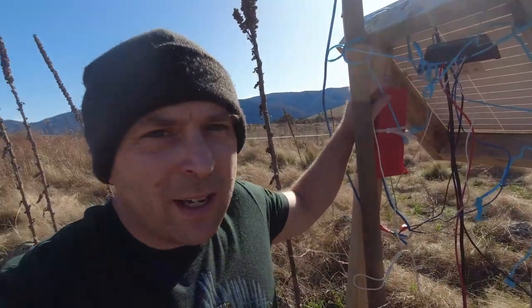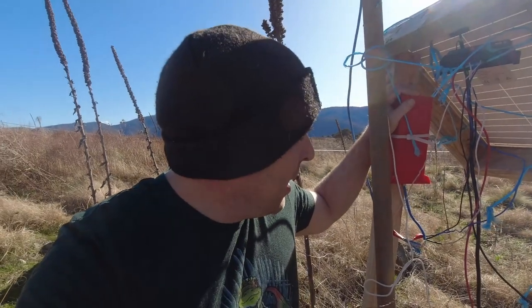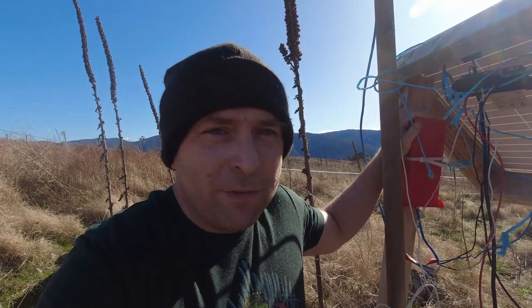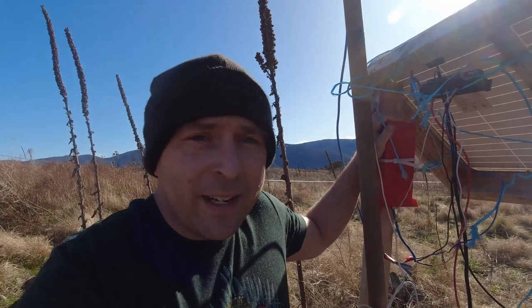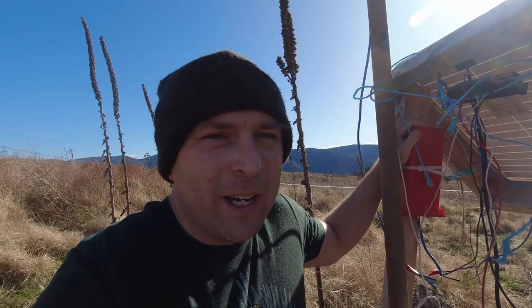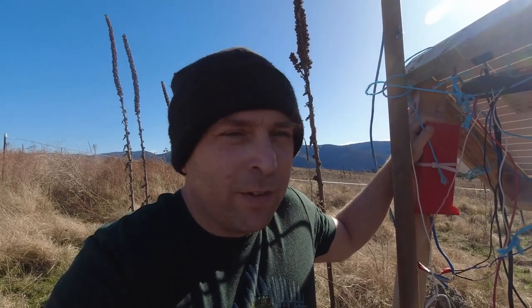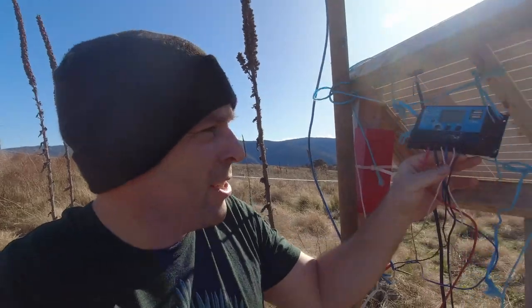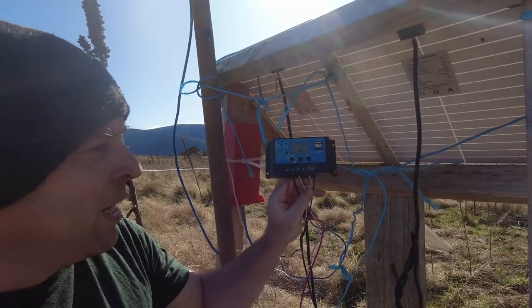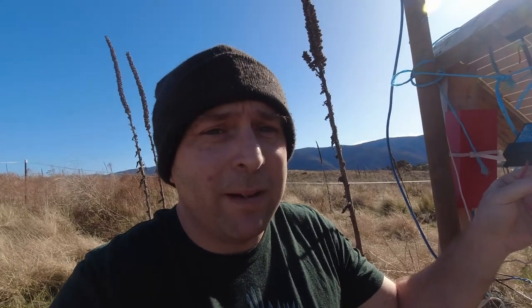To power this we've got this little contraption here behind me. I made this — it's a 3D-printed battery holder — holding my own custom battery pack that I put in there with the BMS and everything. I'm powering it through Power over Ethernet. Instead of having a PoE adapter plugged in here, meaning I'd need a 240-volt inverter and all the rest of it, I'm just running it straight off this very nasty, very dirty, cheapest solar charge controller money can buy.